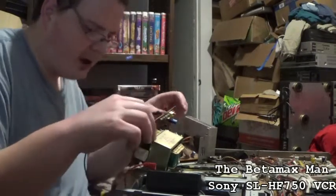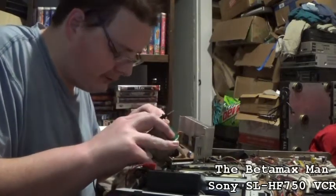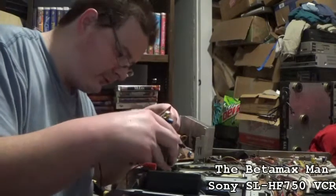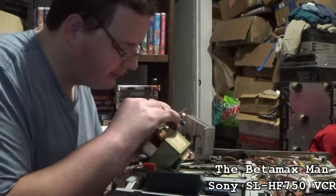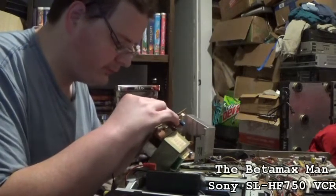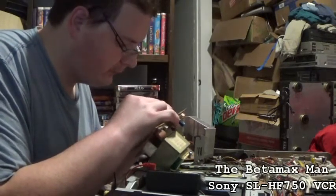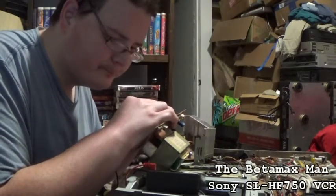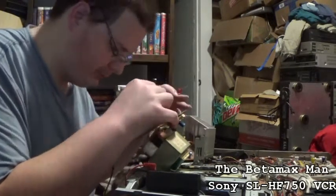Okay, that cap is not registering very well, so that one could be bad. That looks like a 16 at 1,000 microfarad. Alright, let's check this one. Just start checking them, because they fail, you know. Especially those Elna capacitors. That one's bad. And that one is starting to go bad. But we got a bad one right there. Yep, that one is definitely bad. It says to replace it, so...